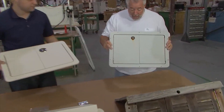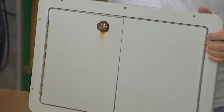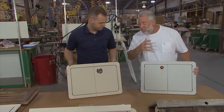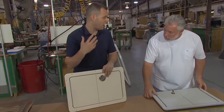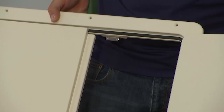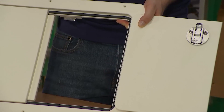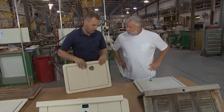This was original on that Chris-Craft, and you can see that this is Starboard but it rattles when you're running. It's also got kind of junky hardware on it and there's a lot of rust. You really can't mill King Starboard or sand it efficiently — it's going to mess up the finish. It's probably best to get a replacement. The great thing about this door is that it's so easy to pull off, measure your hole, cut out, and order an exact replacement. In this case, we milled into the returns and integrated a bulb seal — not an adhesive seal that's going to pull off, but one cut with a t-slot and pressed into place. It eliminates any rattle of the door against the returns, so when you're running your door is completely quiet. It also cuts down on water intrusion and makes it more water resistant.